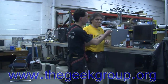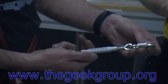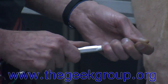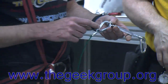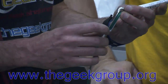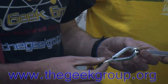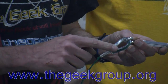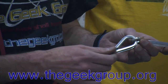Now, hang on, let's show this for those following at home. We've got our turnbuckle here, which allows us to lengthen the assembly, and we're setting these to zero all the way in and then snugging them. So this is the turnbuckle with two eye bolts. We have the thimble here, which is the metal liner that keeps this from crimping down. And a big purpose of the thimble is you can see we crimp them really tight at the thimble. And what this does is makes this a consistent distance, because without that, it'll chafe there. The plastic liner of the cable will want to chafe off.